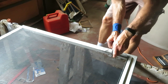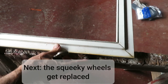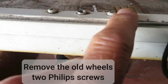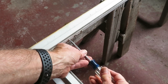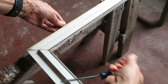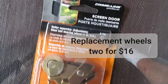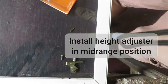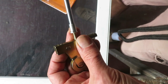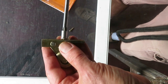And that completes the screening process. The old wheel is no good, so I'm going to replace that — just a couple of screws. That tube in the middle that I'm putting the screw into right now is how you adjust the height of the door. For now we're going to put it in the middle position and make the final adjustment once the door is in place.